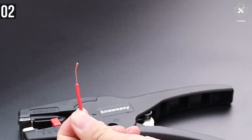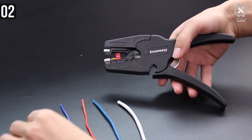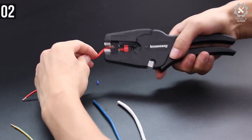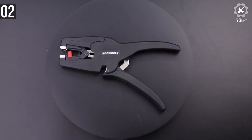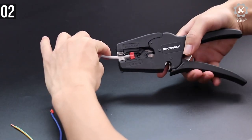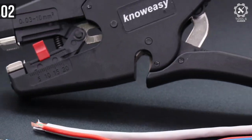Without readjusting, you can cut precisely from 0.03 to 10mm² — that's a really fine range we're working with here. One of the best parts about this wire stripper is the price; having a 2-in-1 tool at this price point is something many could only dream of. While it's capable of stripping wires quite easily, do not attempt to cut steel wires with this tool.